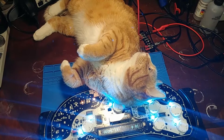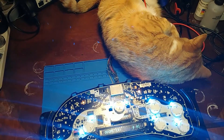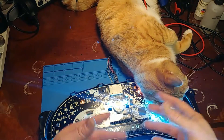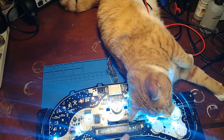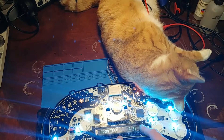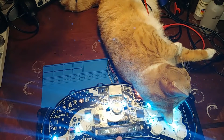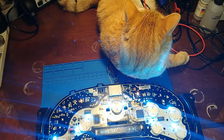I don't have a cloth chair, I don't have carpeted floors. I think what's happening is people are handling the board and damaging the microprocessor, because when you run into odometer error, that's the EEPROM that has issues. But when you run into odometer zero, it is the microprocessor that has issues. And I've got to be pretty sure that it's static sensitive.